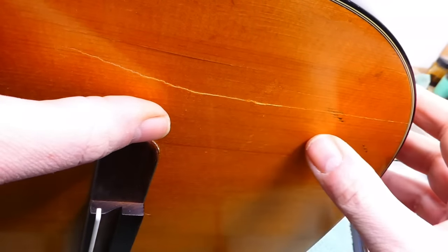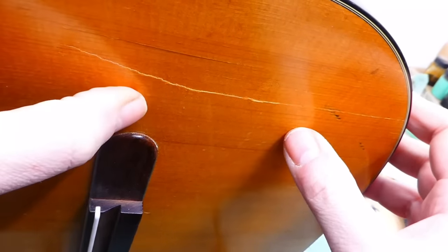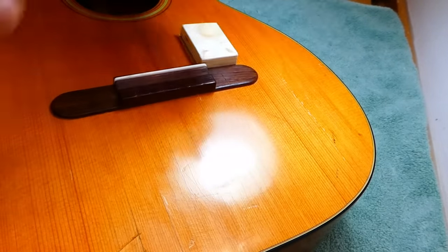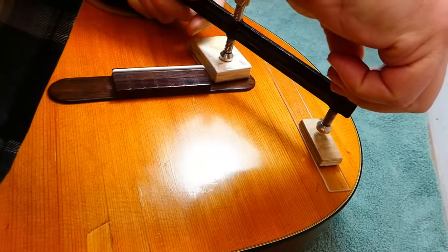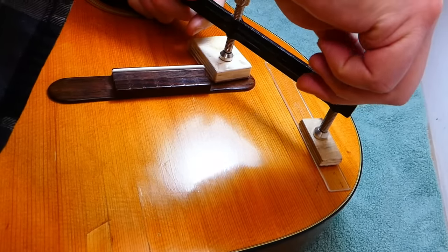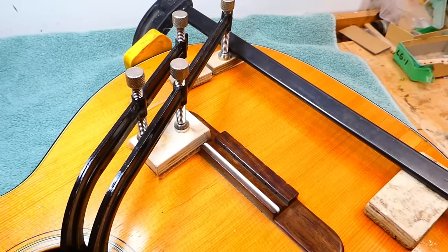This top crack is fairly tight, which is nice. It's also kind of odd in that it veers off — it doesn't follow the grain line directly; it jumps over. Gluing the crack proceeds as usual. I'm using fish glue this time. Paint it on rather thickly, grab my suction cup and pump it right through to the other side of the soundboard. Then using the longest of my long-reach clamps, I'll put some pressure on with a piece of acrylic plastic, bridging the crack to try and keep it level. A gentle squeeze for some lateral pressure, and we'll let that dry.